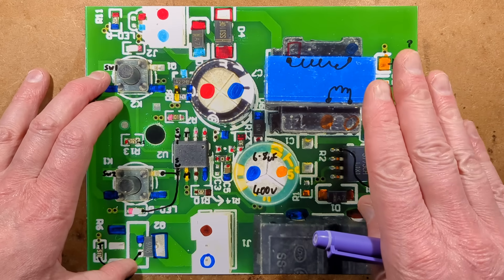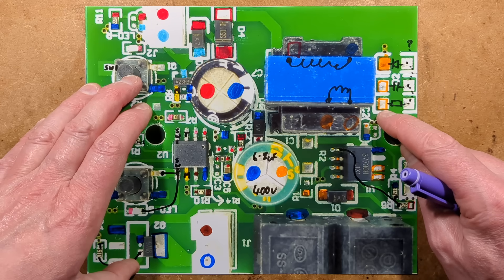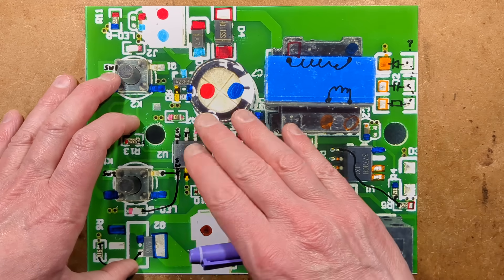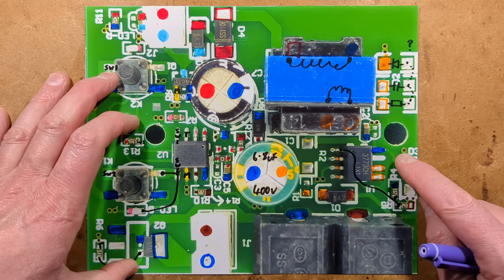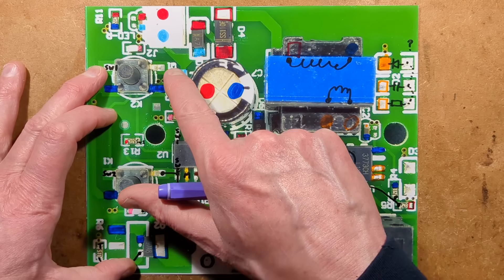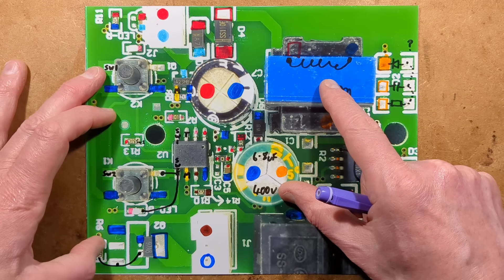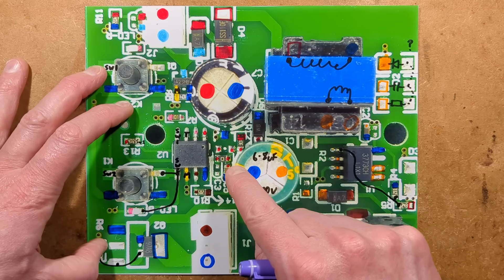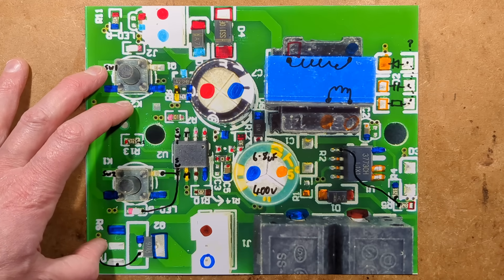Here is the power supply section. It goes to the power supply and also provides a reference to the microcontroller for zero crossing point detection, while also powering the heater via this track. The heater is based on a fibreglass cord with fine wire wrapped around it, then covered with PTFE — Teflon — tape. That's the only insulation between the heating wire and the user: just that layer of Teflon tape. There's a snubber network footprint for protecting the transistor in the chip, but it's not populated, and they haven't even connected the tracks that should be common. The whole circuit — including the feedback on the supposedly isolated supply — is referenced to the mains.